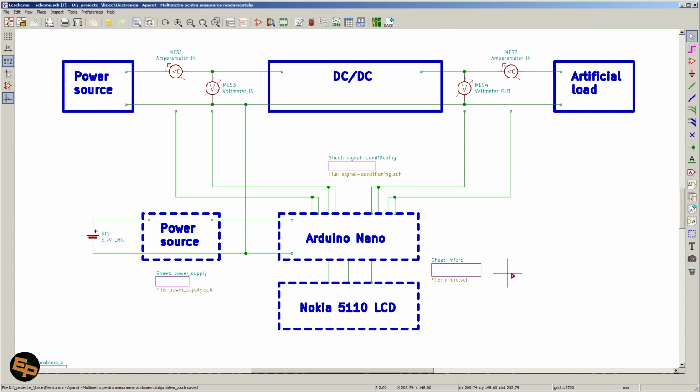and for the entire multimeter as well, which means we will not be able to measure inverting DC-DC converters or power supplies with isolation. Those will not be able to be measured here, although we probably don't care about those, or if we want to measure those, we will essentially create a different device, or we will think of a different design for those problems. I only cared about measuring DC-DC converters efficiency, step down, step up, not inverting ones and not isolated power supplies.